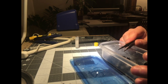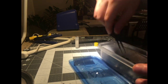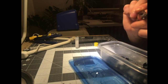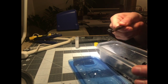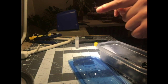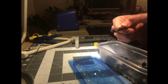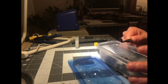Oh, interesting. I would have to see what you do then. I feel like I can't picture what you're doing. But one thing I noticed is that when I was doing a build with 205 grade zero, I got the top housing. Oh yeah, I don't mess with the top housings anymore. I never lube the top housings anymore. Way too lazy for that. The actual back edge corners and getting in the little crevices around the rail turned out to be super important. Yeah, lubing the lower housing is like 50-50 for me.